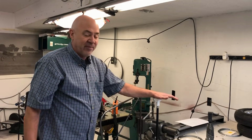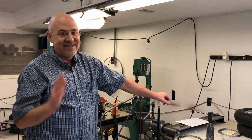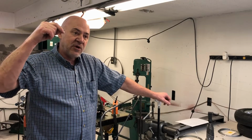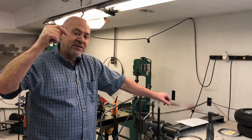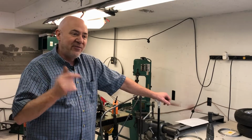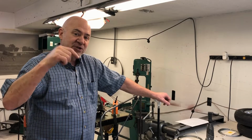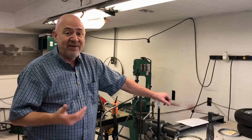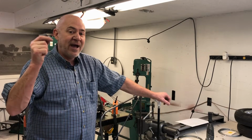So I just want to really stress to everybody that the steadier your hand is with TIG welding, and I'm talking about this for the novices, if you've TIG welded, you know exactly what I mean. You have to have absolutely rock solid hands, because when you start that arc, with your torch going on the TIG, if you dip the electrode into the molten steel, you really need to stop and regrind that. Sometimes if you've got a weld going and you just dipped it a little bit and the torch still looks good and healthy, the color and the direction that it's working is still solid, you can keep going. But a lot of times, especially with me, if I accidentally dip when welding aluminum, I just stop and regrind it. But the more steady your hand is, the less likely you're going to actually dip it.